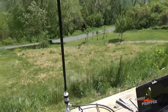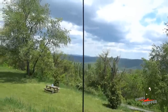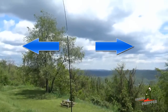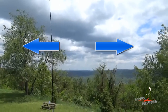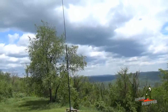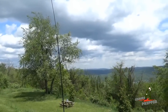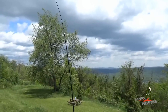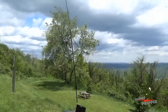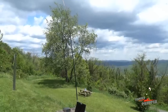Right now in the vertical position, if you imagine a donut wrapped around this antenna, the radiation pattern is at 90 degrees from the antenna, going out horizontally. That's good when you want to talk long distances, but I like to do a lot of HF data operations with stations within my state or neighboring states. So in that case, I want to tip the antenna down horizontally — it will point my signal up straight into the atmosphere so it comes down closer.